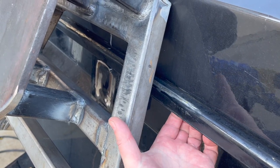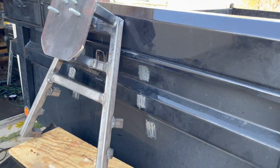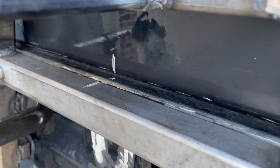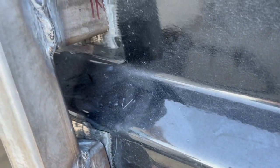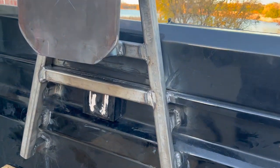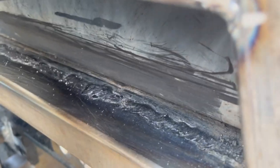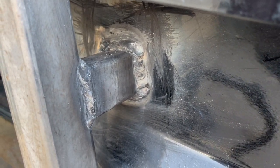I'm going to get this up in place, use C-clamps to clamp it right up against there, get a full bead of weld across that top edge, and get all six points welded in. I think we've got a pretty decent fit — let's get it totally welded in place. There is the finished product. We'll get the tire on here in a second to check height against the cabinet, but I'm happy with how that turned out. We've got a full weld in that gap, a full bead along right here.